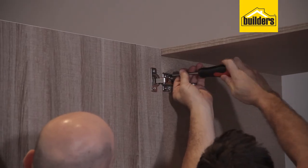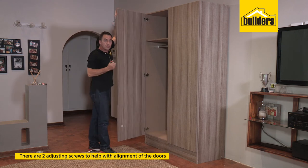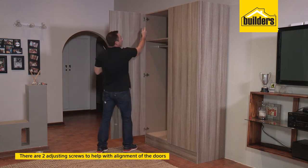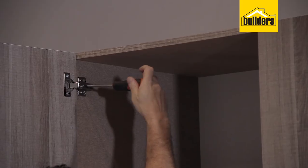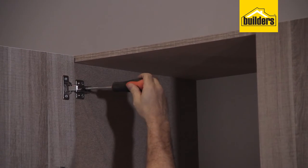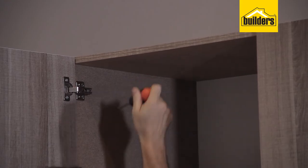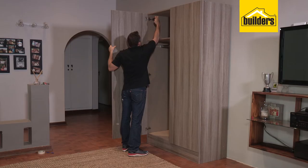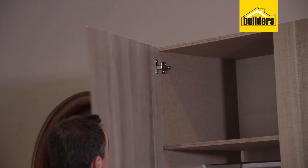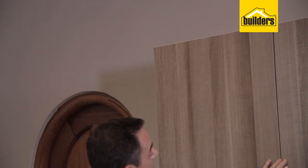Adjust the height of the door with the slotted guides. For fine-tuning and alignment, there are two screws on the hinges: the back screw adjusts the door back and forth, and the front screw adjusts the gap between the doors and ensures the door is square to the structure and to the other door. As you screw that in, it pushes the hinge towards the other door — straightaway you can see the gap size changes. Once you're happy with that gap, the doors are aligned.